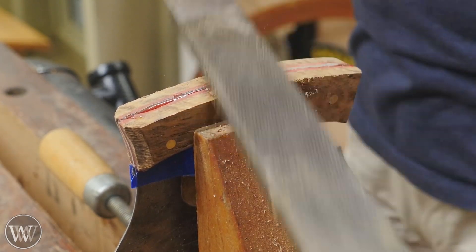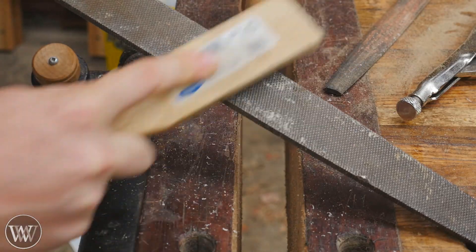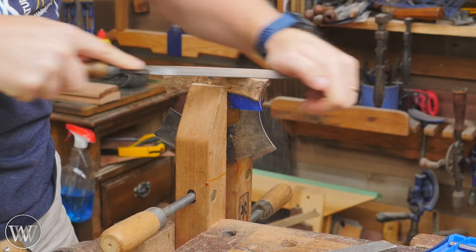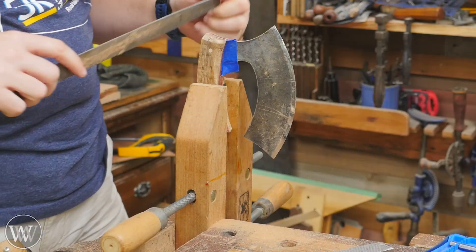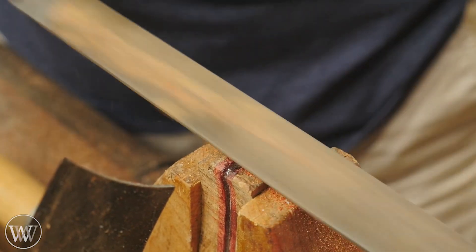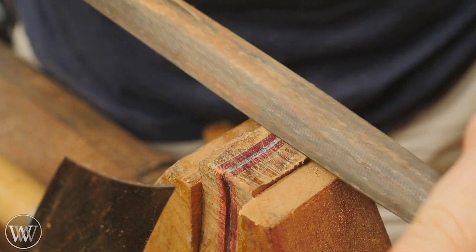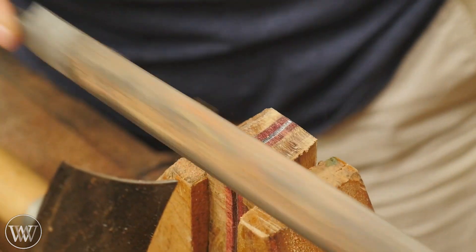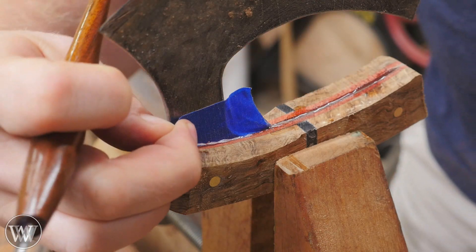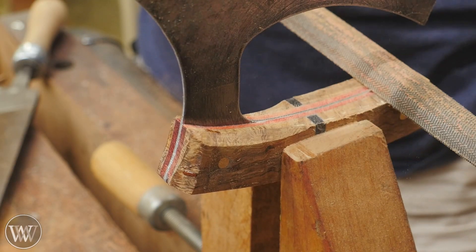The next process, which is going to take a lot more time than I expected, is grinding all of the wood down to the steel because I want the steel to poke out. I'm using a file card to clean off the file because it loads up with all the epoxy and rough wood, so I occasionally have to stop and clean off the file so it cuts again. I want to be careful that I grind down to the steel but don't hit it too much because the steel is hardened and that will hurt the files. I am using files I don't care quite as much about, so when I do that final scratch and hit the steel, it's not too much of a concern. Running all the way around, cleaning it up to the steel - I really like how this comes out. You start to see the red lines, the steel and the white oak. When we clean the tape off, the epoxy comes with it really nicely and you get that crisp edge all the way across.